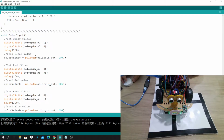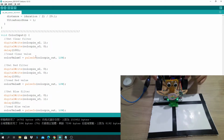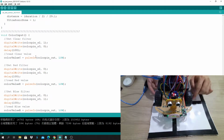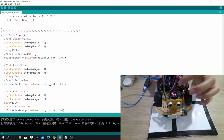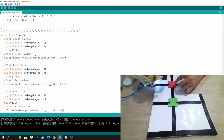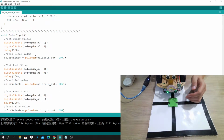So that's why when you do the project, remember to use the far left and far right sensors. As soon as those 2 sensors see the black line, stop the car and use the color sensor to check if it is green paper or red paper. It's the best method, because think about that.